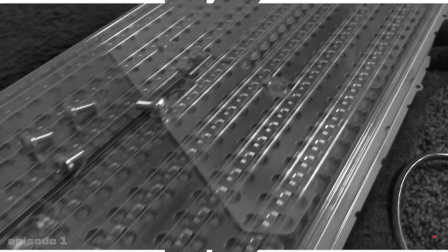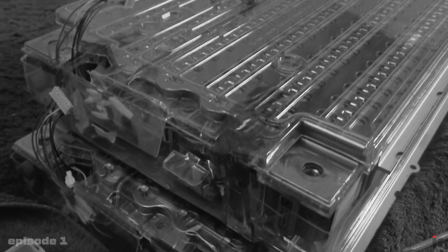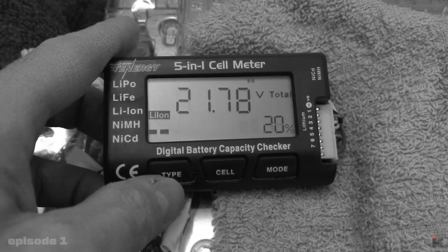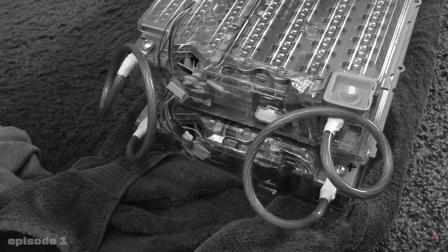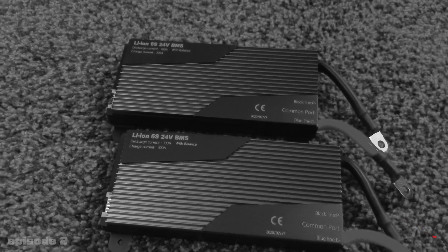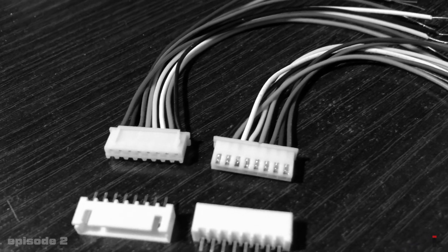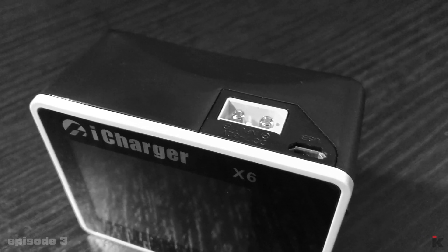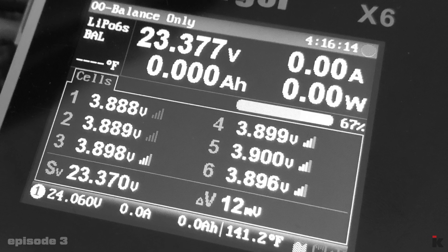I mentioned how important it is to consider having backup power to your tank using recycled lithium-ion batteries. I removed the Tesla BMS, added a cell meter, and then balanced the two modules by connecting them in parallel, added a BMS to the Tesla modules, and temporarily wired everything together. I showed how I use an iCharger X6 to post-balance the modules and did a few real-time tests.